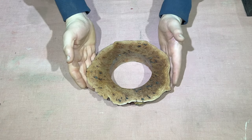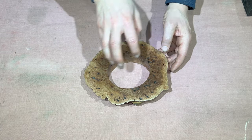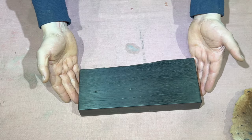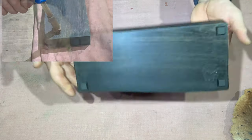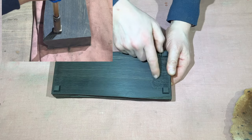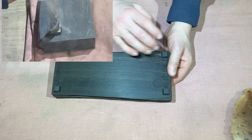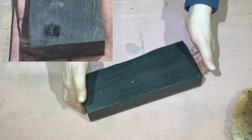I've now got all the components waxed, hand finished in there to 180. It's not going to be seen very much at all. My bog oak, I finished to 400 grit, rounded the corners off, so nothing too sharp on the edges and corners. Put my brand and piece number 847 on there. Put some nice little square feet on the corners. That'll keep it nice and protecting of surfaces.